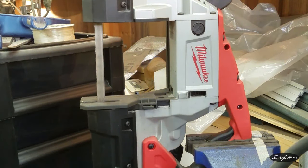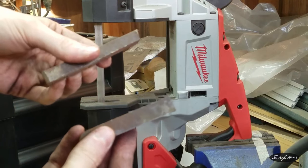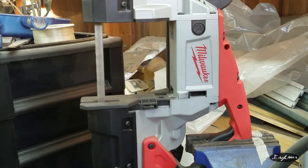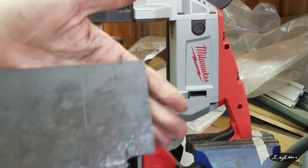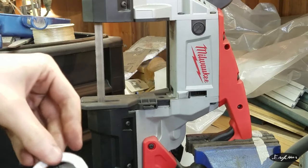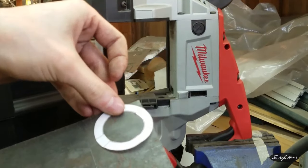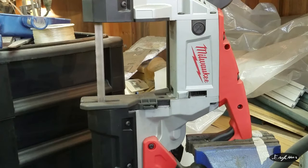And this is going to be about 50-50 stock removal, 50-50 forging. I've got the two pieces I'm going to use for the limbs. And this is going to become the circle, which I'm about to cut out. We're looking at roughly 5 inches for the ornament overall length. So we'll get started with the stock removal bits and then move on to the forging.